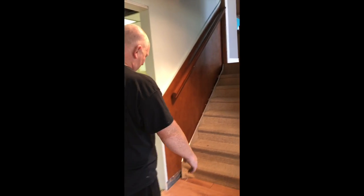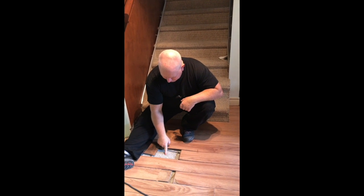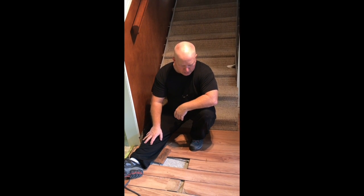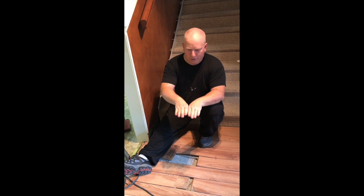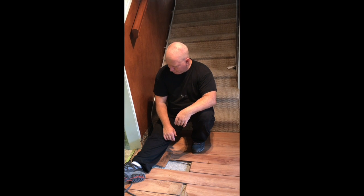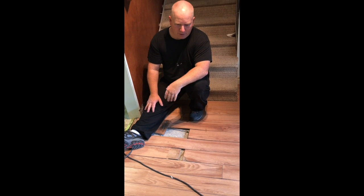The next thing these people did — I think they just wanted to sell quickly and covered it up — but there's underpad here, and you really shouldn't put laminate on top of underpad because your floor, even though it might be a little bit warmer, feels kind of spongy, and over time the joints open and close and it can actually break the joint. We've also got some investigating to do because it's a little damp and I'm not sure what the reason is — we need to find that out.